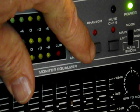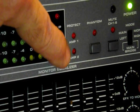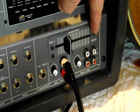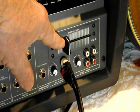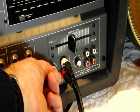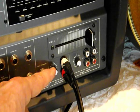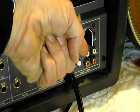The next button is phantom power, which sends power to special microphones — of which we have none in our community. Here you can see if there is peaking of the two amps if they're overdriving. Another feature at the bottom is that you can plug in two different stereo sources, and this slider allows you to fade from one to the other for a smooth crossover. These white knobs are the individual volumes for each stereo input. So if I'm playing an iPod through one channel, I've got to turn the volume up on it. But if the slider is all the way to one side, no matter how much volume is on the other side, you won't hear anything from those inputs.